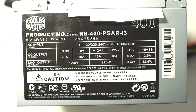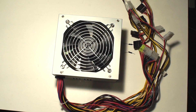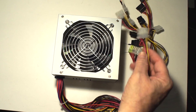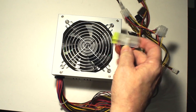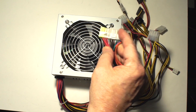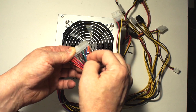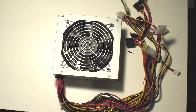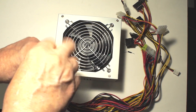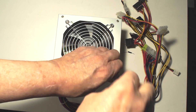It says 276 watts at 12 volts, which would be 23 amps — so that would supply power to most transceivers. There's a green wire on this multi-pin connector that, when taken to ground, turns the power supply on. It's like the front panel switch grounds that green wire. So what I'm going to do is undo it from the bundle and just take it to ground, leave it permanently on. The switch that's on the outside of the cabinet will work. If you have one that doesn't have a switch, use that green wire — just take it to ground through the switch. Now let's see what's on the inside.